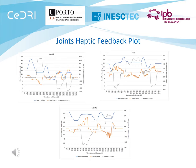In every control loop of the local arm, an updated value for the load cell measurement is calculated. If the values taken from the remote load cells have different signs from the local ones, it means that there are forces being applied in both arms opposing one another and therefore some sort of active feedback must take place. To demonstrate this functionality, three plots are displayed, one for each joint. The purpose is to demonstrate that when there is a force strong enough applied in the opposite direction of the movement, the joint does not continue moving, even though the user keeps forcing the joint. This indicates there is a constraint in that movement and therefore the user becomes more aware of the remote environment.